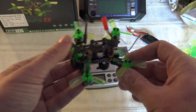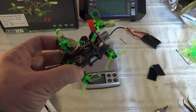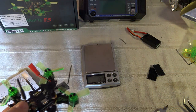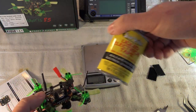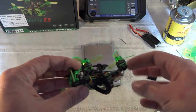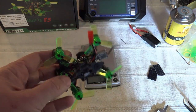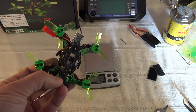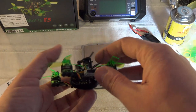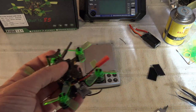So it's super easy to access, no problem to access the USB port. Soldering jobs are correct, well, not super, maybe not fantastic. I always advise with such an open system to add some liquid electrical tape to make the system waterproof. Especially if you are flying over some wet grass, you can save your machine. Spread it here and you will avoid some shorts. Anyway, nothing else, and the buzzer is here, installed on top, great position, no problem.